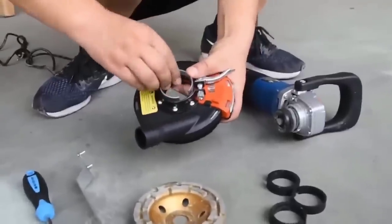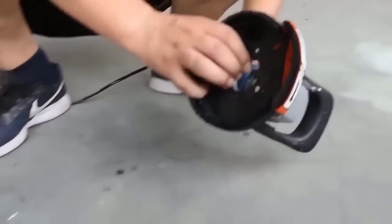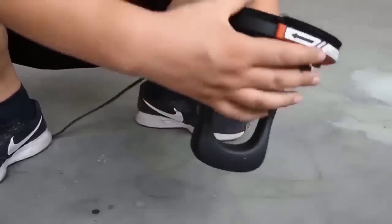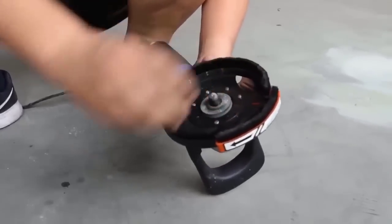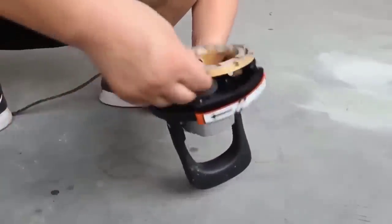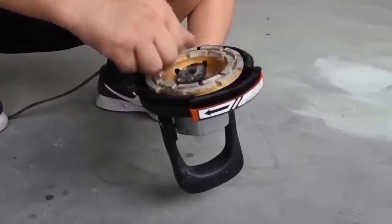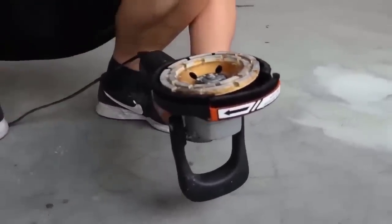The exhaust hood has an optimized flow channel designed for grinding with particularly low dust generation, for both internal and exterior work. The hood features quick installation without tools on a suitable sanding machine head. It has a non-lost insertion element for quick opening without tools when working close to the wall, including when wearing gloves. Anti-static plastic prevents the accumulation of electrical charges and dust to ensure constant high-extraction performance.